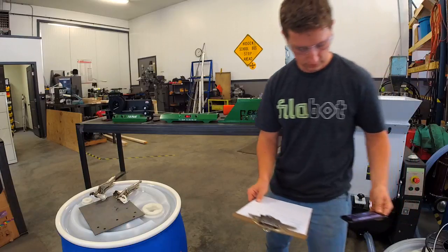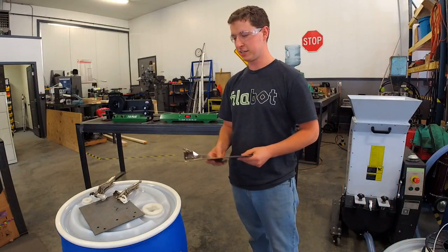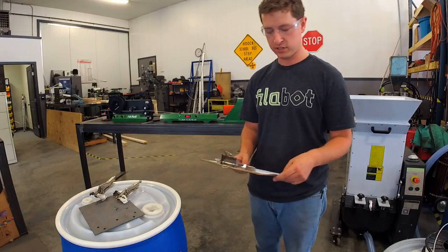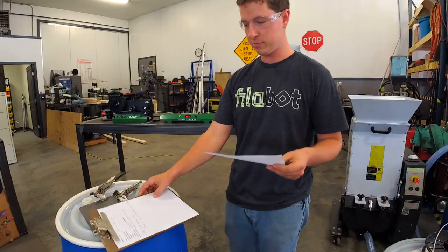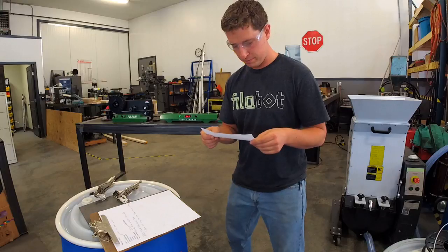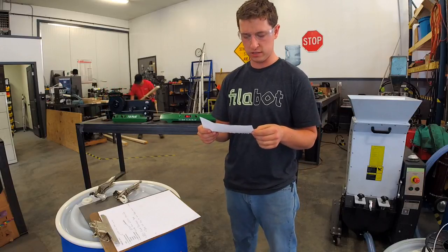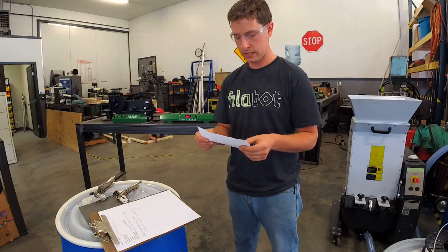Okay. So another prop. Plastic of the week. Thought that sounded cool. This week we have a plastic from SK Chemicals. The name of that plastic is called LE200. LE200 is an engineering grade plastic. That's what they call it. Which mimics rubbers or other TPU materials. It's flexible and resilient. Has a Shore hardness of 40 or 45 or 55, excuse me. It's a Shore D.